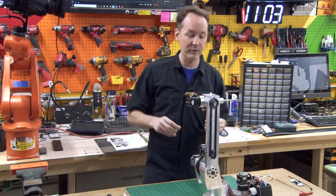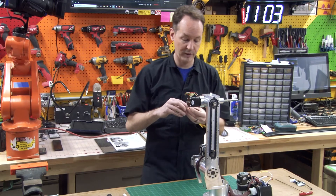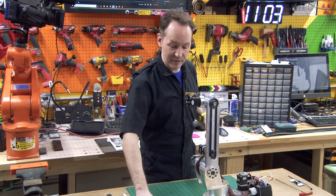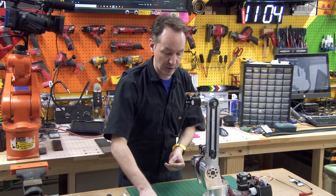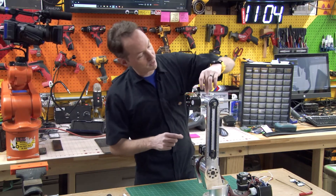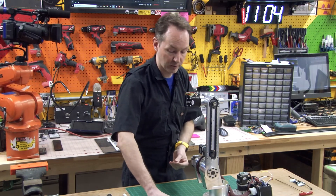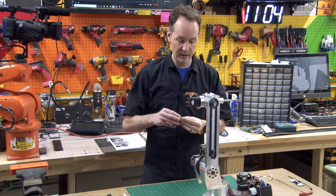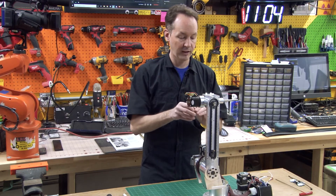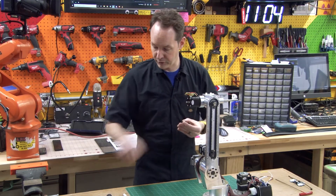You could probably do this if you wanted to be fussy about it and didn't want to resort to 3D printing — there's nothing wrong with 3D printing, it's just I don't want to do that if I don't have to. You could do this with a nylon standoff, or you could go metal if you want, there's no reason not to. You could get one that's a little longer than you need, experiment with washers to get your accurate thickness, then put in a solid metal standoff and file it down to the required thickness. For me, I'm going with six washers. I'm going to measure this before I put it on.